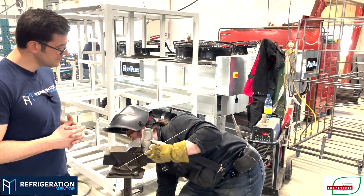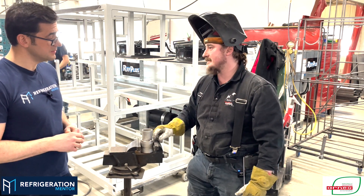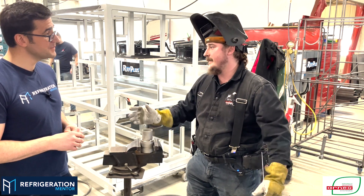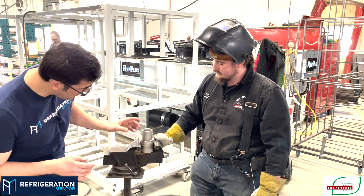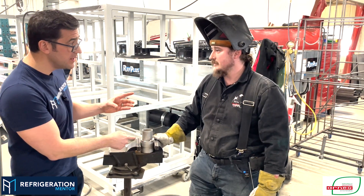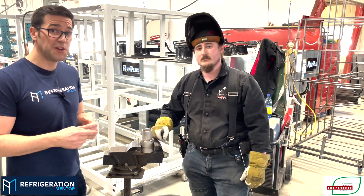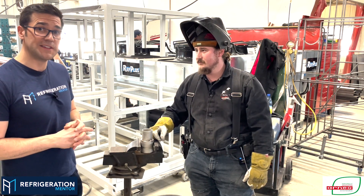Once it's tacked, you brush it up. Now we start with the first pass — we call it the root pass. We do two passes: the root pass and then the capping. The root pass is where you really weld in the root so it's nice and solid, and the capping is like a second measure. It was done by TIG and yes we call this a tack weld. Using the proper terminology is very important in our industry. Now Chris is going to show us the next steps to properly welding stainless steel.